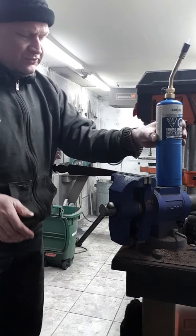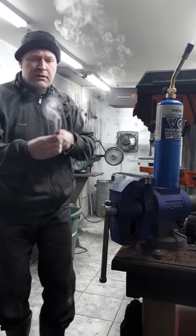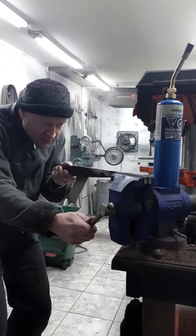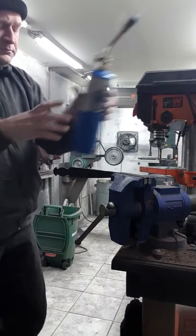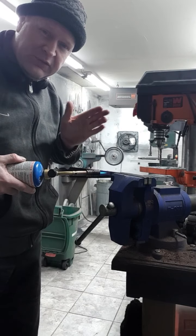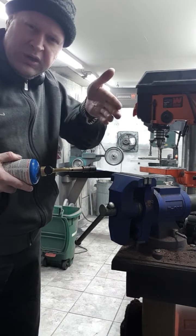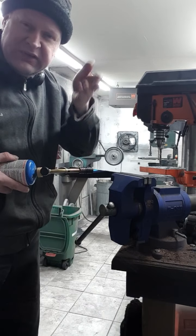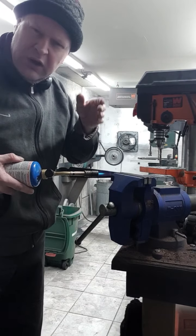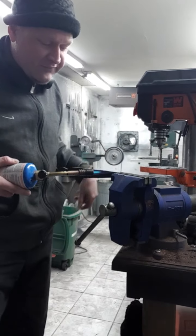Okay, I'm going to go back to my original position where I was after cooling it down. I'm not quite back in the original position, so I think there was like 3 waves in total. So, you know, the stress pulled it one way. When it went into the water, it could have been off center a little bit, and one side touched the water while the other side got a little bit more vapor. That's always the trick, getting straight into the water. But all you have to do is do these simple stages afterwards and you're okay.